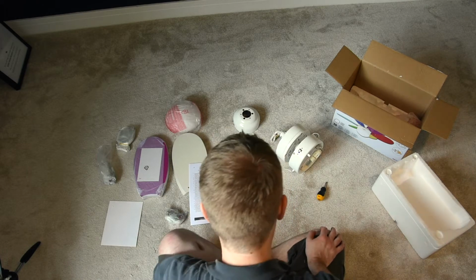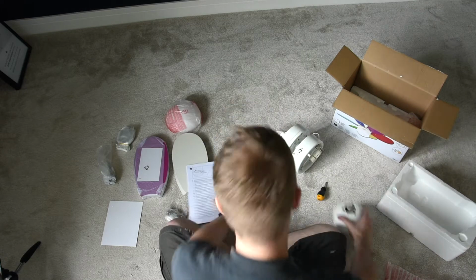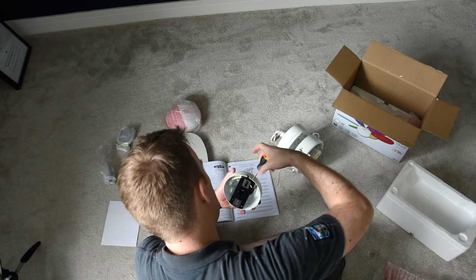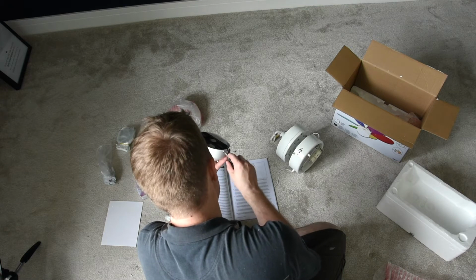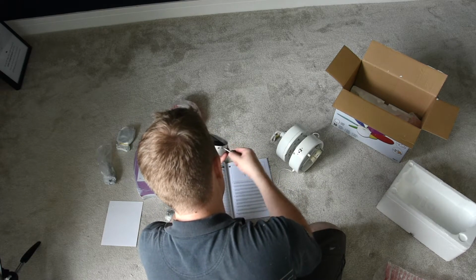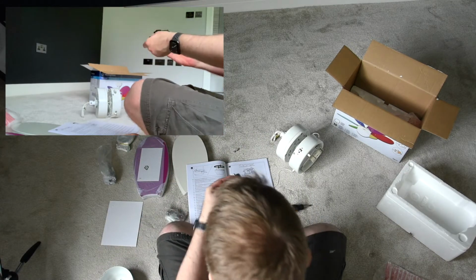Right, let's go and do that. So I need to turn off the lighting ring upstairs. Okay, lights are off. Power is off. Then, take this apart. So, unscrew. Another screw. Right, so this is the bracket that goes on the ceiling.